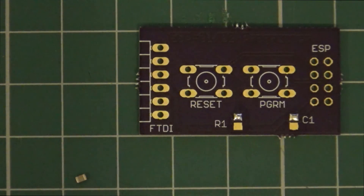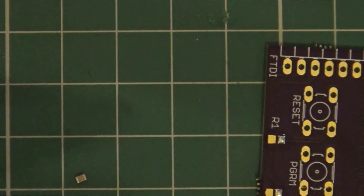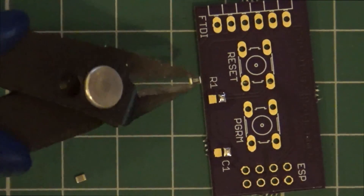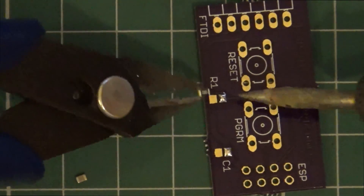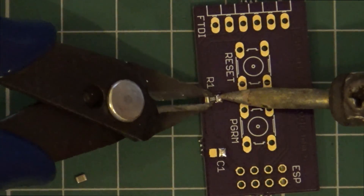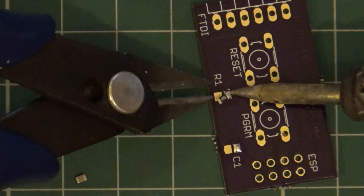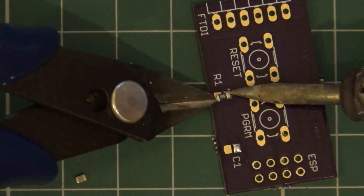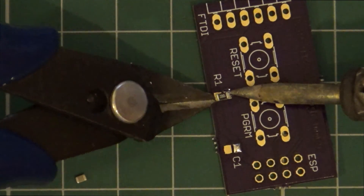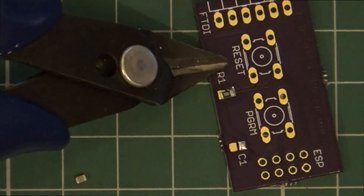The resistor, however, does have some markings. I don't have any pliers with me currently, so I'm just going to use the tip of these cutters to very gently pull that. Since you've only put solder on one pad, you just reflow that solder — it's quite small so it should reflow quite easily. Then you can make sure you get it far enough along, and if you keep the soldering iron on there you can nudge it where you want. This is extremely difficult from a distance. Okay, so that's one side down.